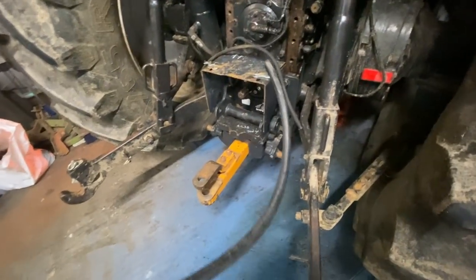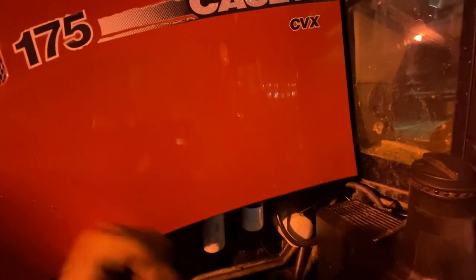I also need to order a cable for it tomorrow. What I'm doing here now is changing fuel hoses — you can see I have an old one here. Here's one I've already changed, going in there underneath the diesel tank. A bit awkward to get at, but not the worst. One of these was fairly perished, so I'm going to change both of them. Then we're on to our diesel filters, fuel filters, front axle oil, hydraulic filters, and a quick run-through to check all codes. That will have her fully serviced and ready to go for slurry spreading.